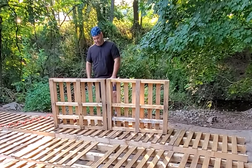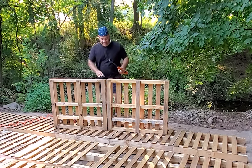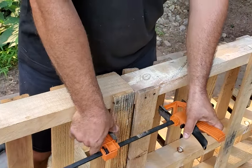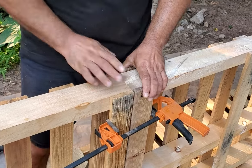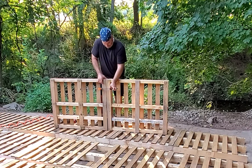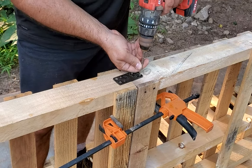Now I'm going to show you how to put the planks together — it's pretty easy. It'll help if you have somebody assisting, but if you're doing it yourself there are a couple of tricks to keep the skids together as you're nailing them. One is you can use a clamp to line them up together. You want to make sure the top is as even as possible. Another trick to keep it nice and straight is to use a regular flat plate or piece of metal.